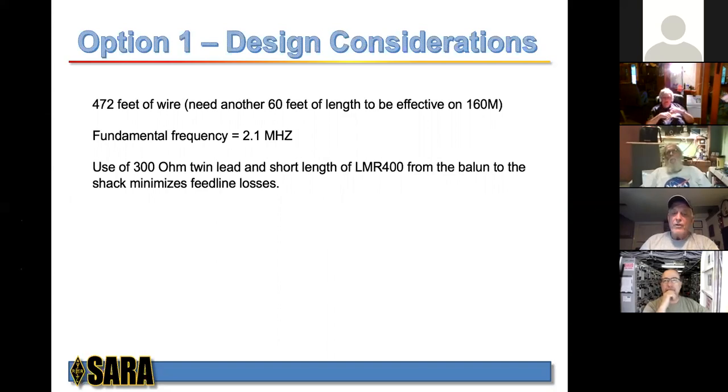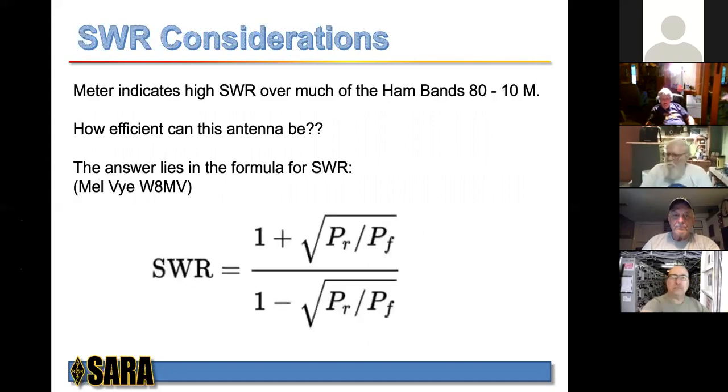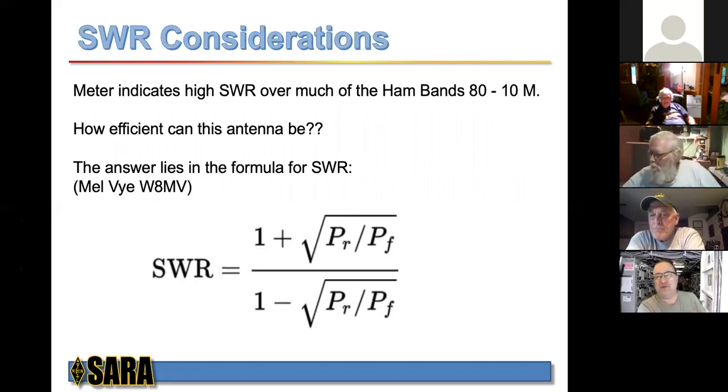If you want more information on that, again, I strongly recommend that 1985 article in QST. Hey, Gary. Yeah. So when you mentioned on 80 meters that could be used as a vertical, does the loop itself become a big capacitance top hat? Is that kind of the idea there? Exactly. Okay, I got you. That's exactly how it works. Yeah, and I was going to talk about that, but I haven't done it yet. I don't know if I'll do it. I think I'd rather add another 60 feet to my antenna. Right. Yeah, more wire is always better, right? Oh, yeah, for sure.